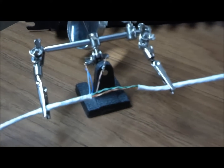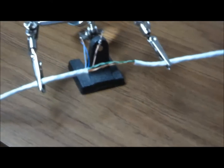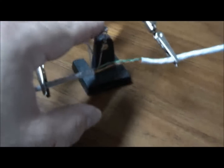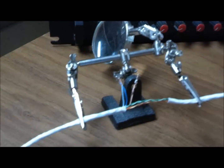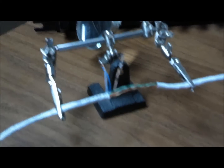Blue we use for positive and brown and dark brown we use for negative. Another thing to note: we cut those wires — don't leave them attached to the RJ45. Cut them, and then we introduce our power here and run out to the camera that way. I thought that was something worth going over since I didn't really talk about it much.